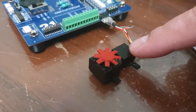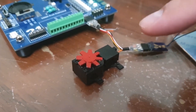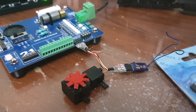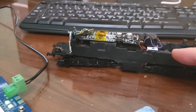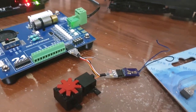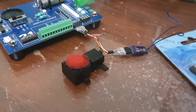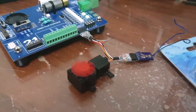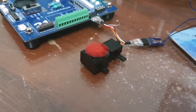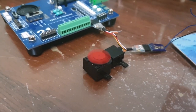And then I've altered the coding of the Zen decoder to actuate the motor via an F1. So F1 is the same as the startup for the sound on the TTS module in the Class 31. So when I press F1 on the screen, the motor spins, and you can set the decoder to spin at a static rate. The only thing I can't seem to get it to do is continually go in the same direction. So when you change loco direction, the fan will also change direction.